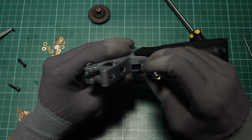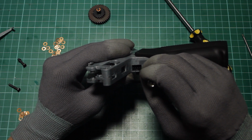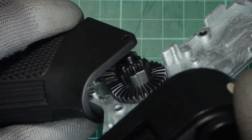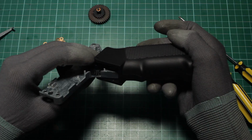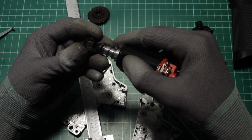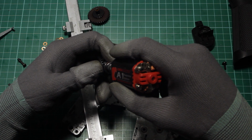In this case, the pitch of the teeth on the pinion gear was different from the bevel gear, and prevented them from meshing all the way. This stopped the motor height adjustment at just about 90% of being flush with the bevel gear. This should still be in the realm of very sufficient contact area required to effectively transmit the power from the motor onto the gears reliably. But we'll see how they hold up over time, and come back to see how they do at a later date.